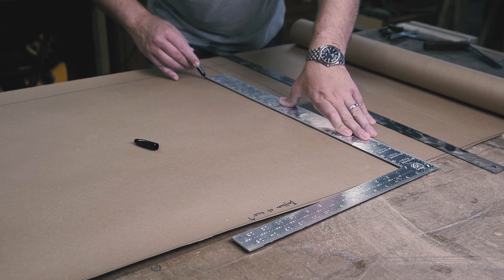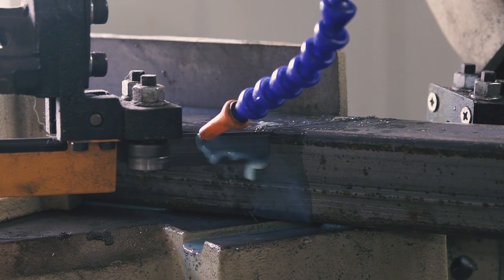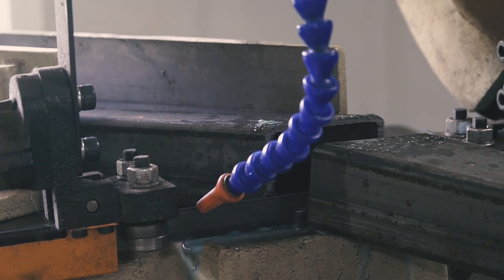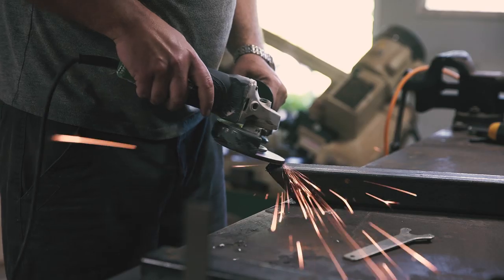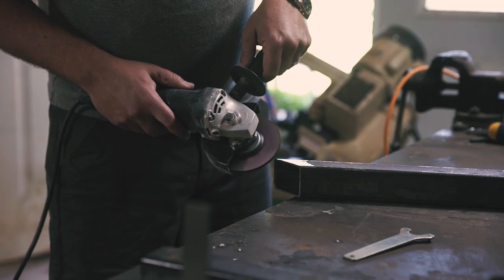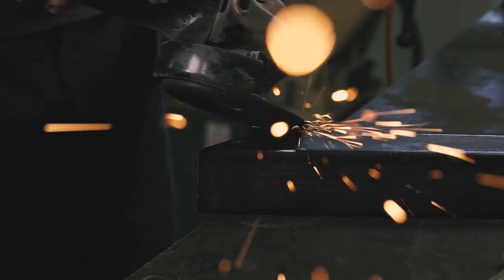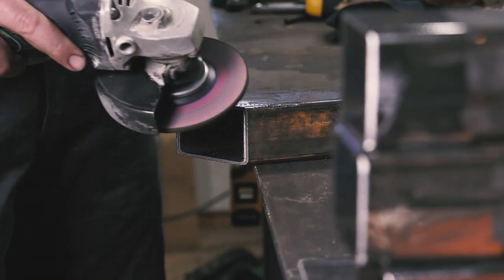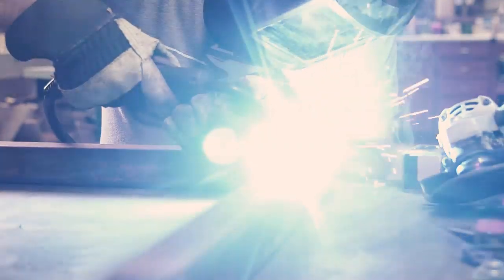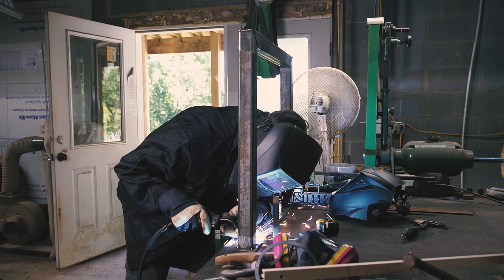Anytime I'm designing anything that needs to be a specific height, where angles are off of 90 or 0, I like to draw it in full scale and take measurements off the drawing. These legs would be an inverted trapezoid with the splay of the leg 4 degrees off of 90. I'm using 2x2 square tube steel cut to 43 degrees. I cleaned up the mating surfaces with a grinder and got to welding. I started with tack welds all around the piece and came back to lay full beads down, trying to move around the piece to dissipate heat and manage any warping.